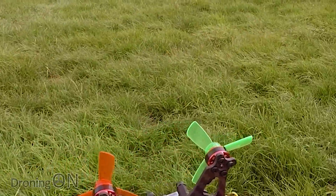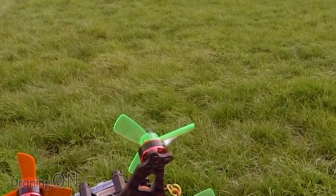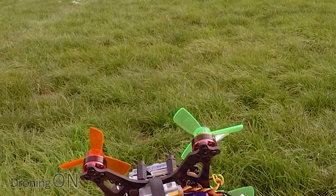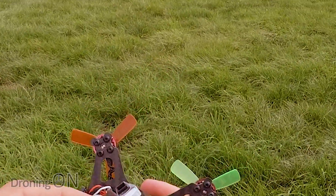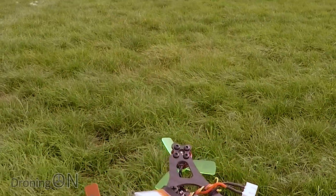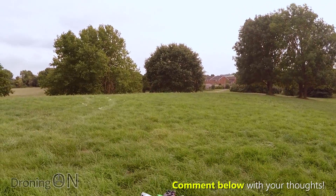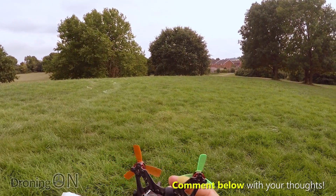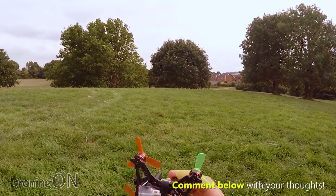As long as you can take apart that drone and find a 5 volt permanent power feed, you're going to be able to charge up the inbuilt battery in the finder device, and as soon as that 5 volt power supply cuts — in other words the battery falling off the drone — it will know to start triggering that alarm. It's a nice little device, very cheap, lovely and compact, very lightweight at only 4 grams, and perfect for any quad. If you want to look at more details, take a look at the video description where you'll find a link to the vFly website. Thanks for watching — comment below with your thoughts, give the video a thumbs up, and subscribe if you're not already.